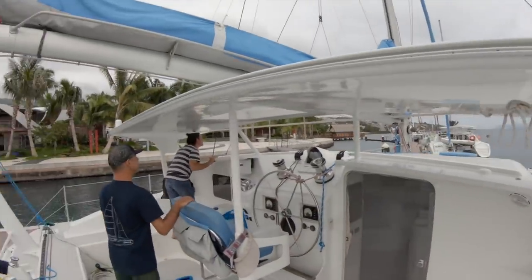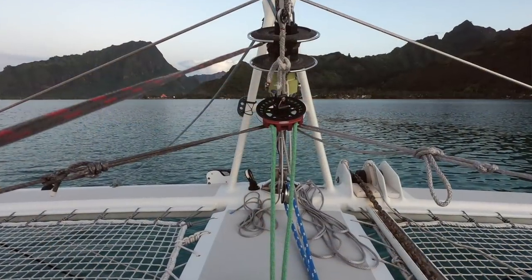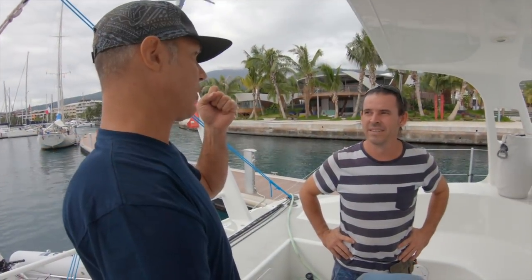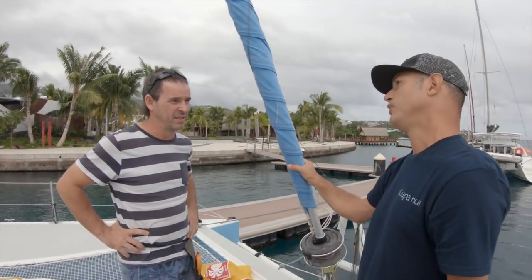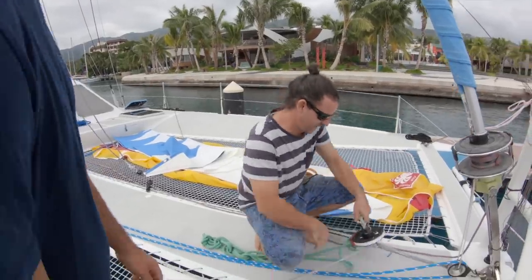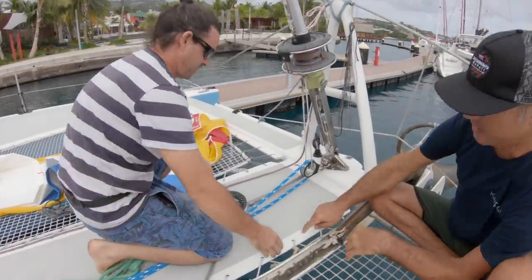There's really no way we can use this smaller sail as-is, so this is the whole idea — trying to figure out how we can use this brand new beautiful sail. I have an idea for how to maybe position the furler, but I don't know if it will work. The sail's set up to pre-hoist so we can look. I'm concerned we won't have enough distance for the luff and that the clew will be too low. The previous owner is a friend of ours and he set the sail up to have a staysail, and then I had to think of how to put it on a furler.